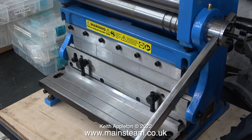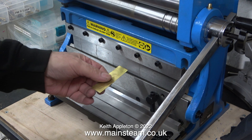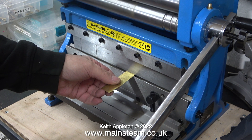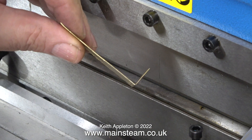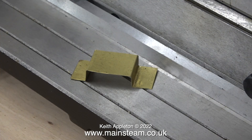This small machine in my workshop is called a Clark Metal Worker. It does have its uses, but it's only for very thin pieces of metal. Using the bending part of this Clark Metal Worker, I'm showing what it's capable of doing, but once again it's only capable of doing this with a very thin piece of brass. I'm going to illustrate one particular method — if I got a longer piece of brass I could make something like this, a special mounting which would hold the burner above the three millimeter piece of steel I'm going to use for the base.